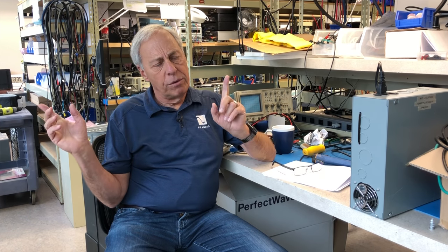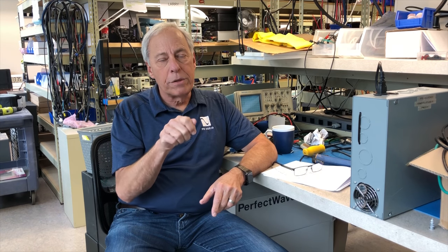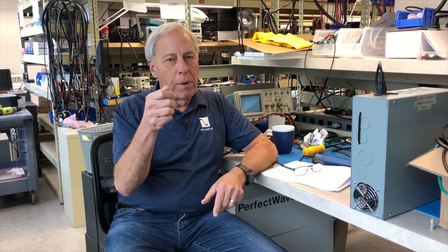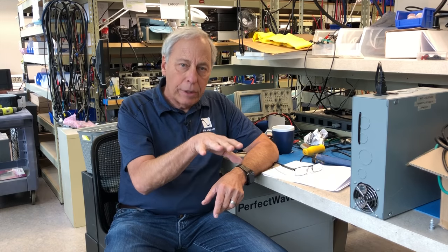There are some tricks, of course. You want to find the best spot for those subwoofers. And one of the best ways to do that, I think I've said this before, but it's worth repeating: take the subwoofer and place it on your listening chair. I know, this sounds weird. Get a long set of cables. We're not looking for quality here. Just set the woofer's low pass filter, how high the woofer is going, to, let's call it 40 hertz for the moment, 40, 50 hertz, 30 hertz, whatever you want. And then have it active in the system, but sitting on your listening chair.